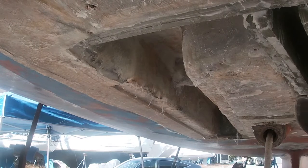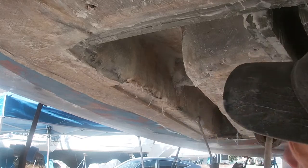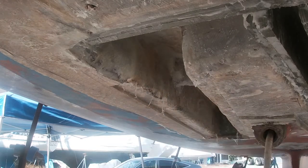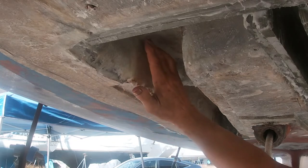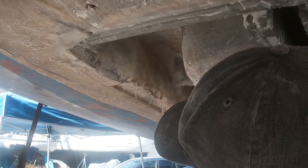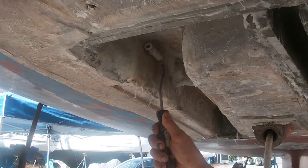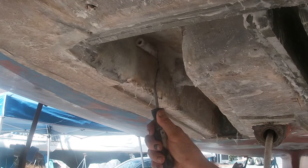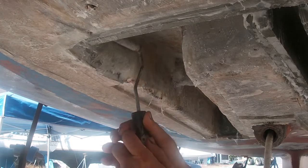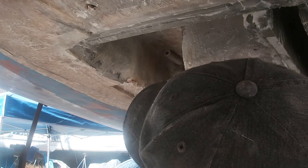This right here is the first layer of fiberglass — it's 1708. We're just going to line the top and down, because fiberglass really doesn't have much strength when it's flat — it's all on the side and in that corner. So we're going to put a piece from the top down, and the same from up here, top down, and then we're going to epoxy a beam to it. I'm just waterproofing and strengthening up the old stringer.